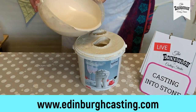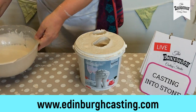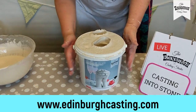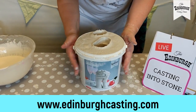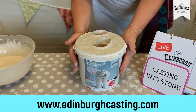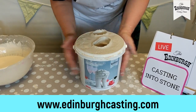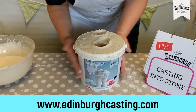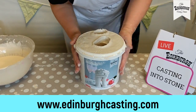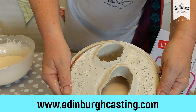We're done rolling. I'm putting in the third amount of plaster — not far to go now. This time I'm not going to roll, I'm going to tap. The reason I'm tapping is I want to get rid of any little bubbles. I've got bubbles coming to the surface here. Any bubbles in your plaster are going to leave holes in your final cast. We want your cast to be as good as possible — these are our top tips. They come in our instructions but there's nothing like seeing it for yourself. I can see little bubbles coming to the surface and this is what we're trying to get rid of.